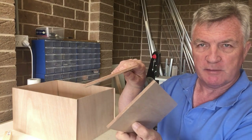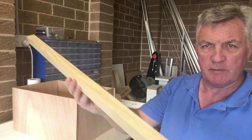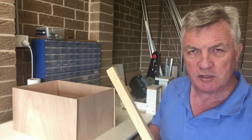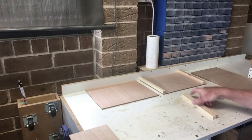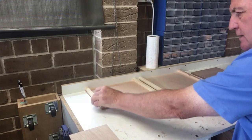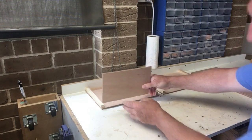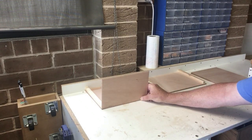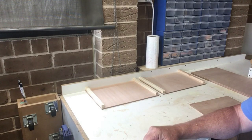As you can see, by just having two pieces of 6mm plywood, trying to nail or screw them together like that just wouldn't work. So what I'm going to do is grab a piece of scrap wood and cut it down to 15mm square. I'll glue these uprights to the inside of the box — I'll probably just pin them first of all to let the glue go off, and once that's dry I can start attaching the sides as well. That's the four uprights cut, and these are the two side panels. The only thing I have to do now is to glue these onto the edges of the side panels. You'll notice there's a small gap down here — that's going to be for the base of the box, and that means the base is going to be inserted and sit neatly inside there.